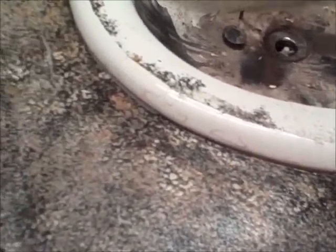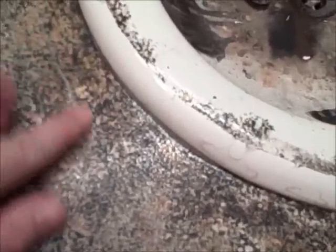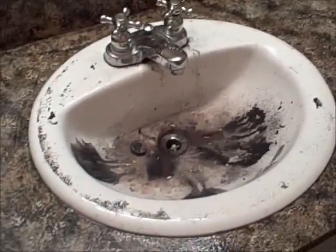What I did do though, which was bad, you know, I always have to have something bad, is I had my ring on. And since I had my ring on and my hand was turned this way, it was scraping. And I have a running scrape along here. Now, the scrape actually went down. You can see it. Runs all the way here. I sanded it a little bit, but I'm just going to re-poly this side because I know that that went down to the acrylic, and that's not good. So one more coat of poly on this side. But rubbing compound for this side, so that's good. And the tape's gone. Wahoo!